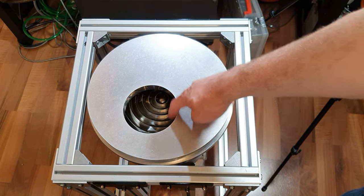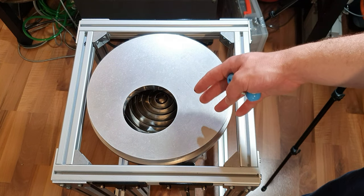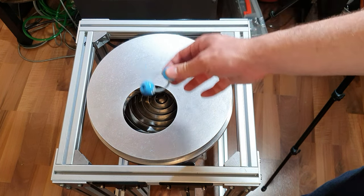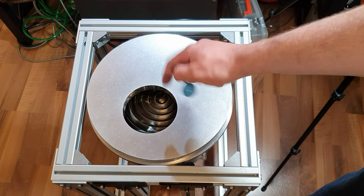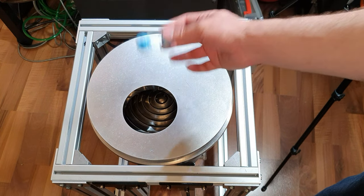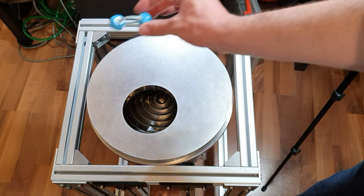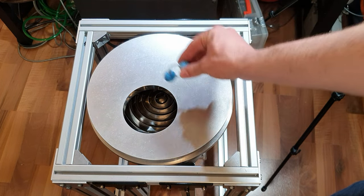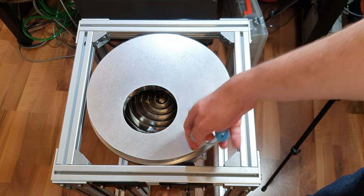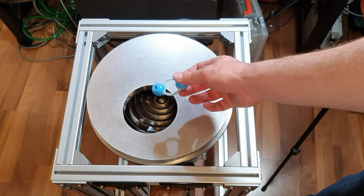If you ask yourself why this hole has to be as large as possible, the reason is that in a vacuum you're not sucking anything. That's a common misconception with vacuum systems. The molecule that is floating around in the chamber here doesn't know that there's a vacuum down there. It knows in the sense that if it's traveling in this direction, there isn't anything it can hit, so it won't reverse its direction. But if it's up here, it's just a statistical thing. It will bump around, and at some point, by chance, it will flow through this opening here, and it will get condensed or frozen in the cryopump and excluded from the vacuum.